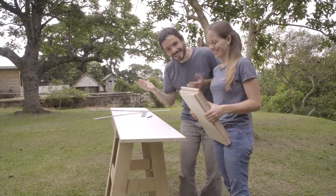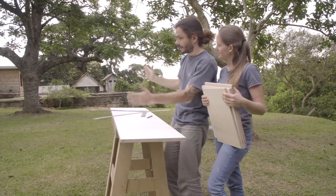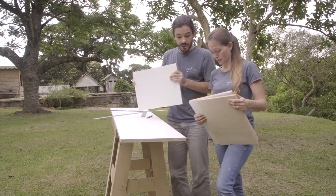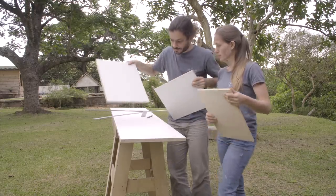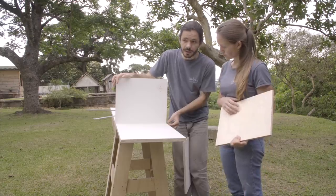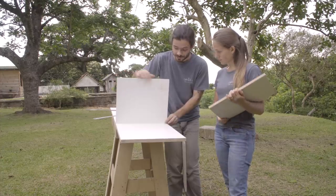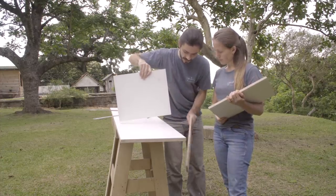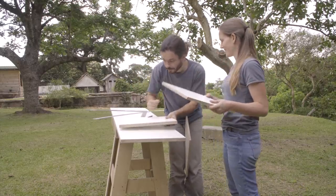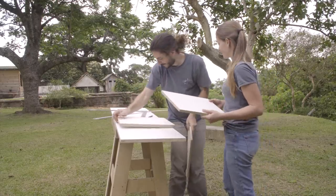This is a tricky one, like always. This is the center column. You know, the wardrobe, there is the right side, the left side, and the center. That's the center. We need to position the shelves. So instead of being like this, we're going to have a groove. Carve, yeah. We're going to carve 3 millimeters, so this goes inside 3 millimeters. Right now we're going to get the router and do a channel so the shelf can go inside. Let's wait and see.